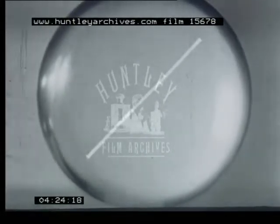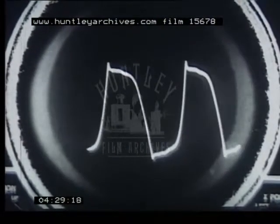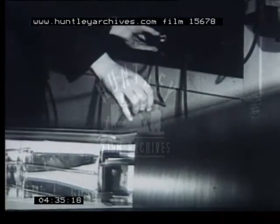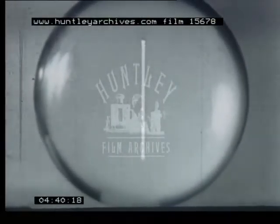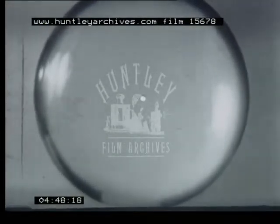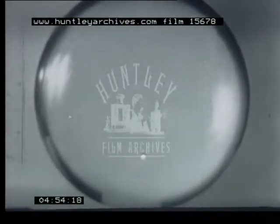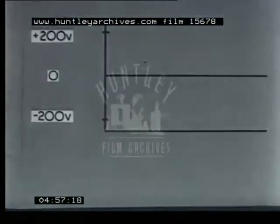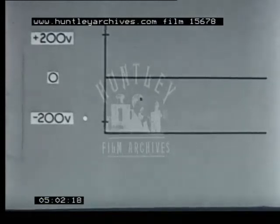However, we usually want to watch on a cathode ray tube more complicated variations, such as those of an incoming signal with time. If we apply the 50-cycle AC mains supply to the Y-plates, we get a line traced out on the tube face, formed by the spot moving up and down 50 times a second. Slowed down very considerably, we can follow the movement of the spot for each cycle, but this movement only lasts one-fiftieth of a second. To investigate the waveform of the supply, we want to see how the voltage varies as the cycle proceeds.